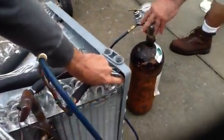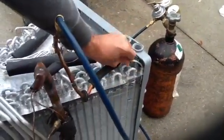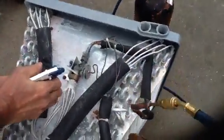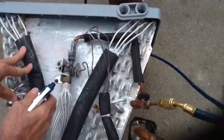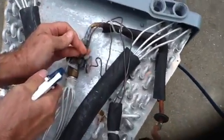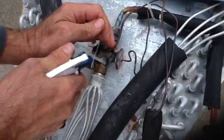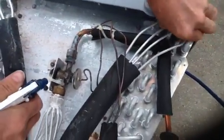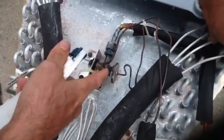Turn it up, then turn it down a little bit. You see right here — this is where this particular coil leaked, right here. We had another leak right here around the expansion valve. Go ahead and turn it on very slowly. This will leak so bad over here. All right, we'll see the bubbles.